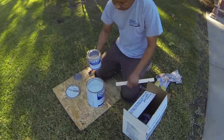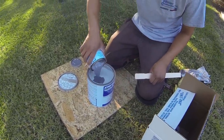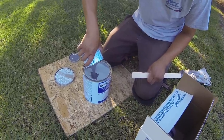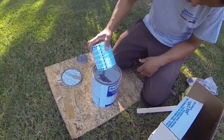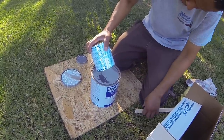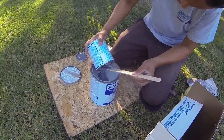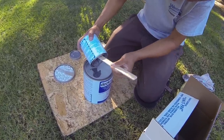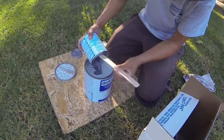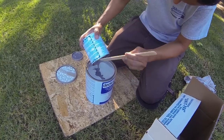This is the product we're using — it's deco seal, a two-part product. You mix the two parts together and it becomes rubberized and complete. Without the hardener mixed in, it will never get hard. Mixing is very critical — mixing time should be at least 10 minutes to be sure it's thoroughly mixed, and then it'll be ready to apply.